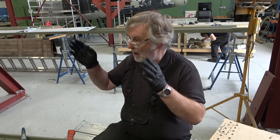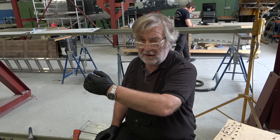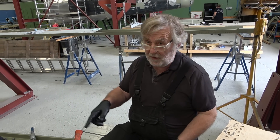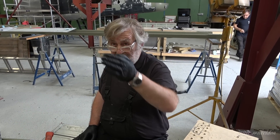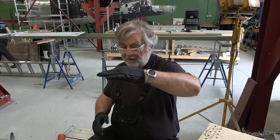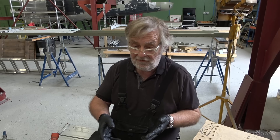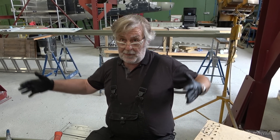When you look at the photographs John's got, the wings are built up with no skins on it except for the leading edge skins — all the leading edge skins are fitted. So what they do is build the front spar up like we've built this, then put all the leading edge ribs on, then put the skins on. All the skins on the top surface are solid riveted, and there's only a small gap, so a lot of the rivets you wouldn't be able to get to if it was installed on the wing.